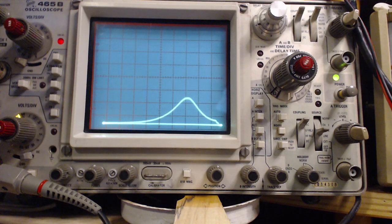There's a lot of stuff coming out of that additional output — the one that should be carrying the audio frequency signal. I'm not sure this is quite what it's supposed to be; it could be cable termination problems. If I've got something here I can work with, I think I do, except I don't know exactly what that marker frequency is right now. Back in the old days, long before people had digital frequency counters, you knew what frequency you were on because of crystals. That's how this is set up, except at the moment I misplaced the crystal.